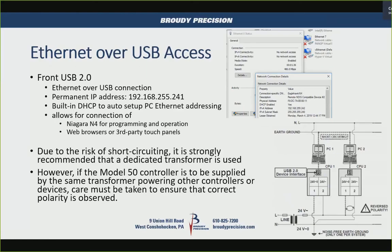There's also a third Ethernet port on the Eagle Hawk. On the face of the controller there's a USB 2 port — you plug in a standard USB cable to your PC and it becomes an Ethernet port. On Windows 10 it was automatically set up with no drivers needed. The Eagle Hawk's IP on this port is 192.168.255.241 — you cannot change or disable it. Your PC automatically gets its addressing from that via built-in DHCP, assigned .242 for the PC on that port.